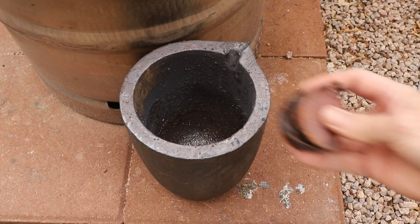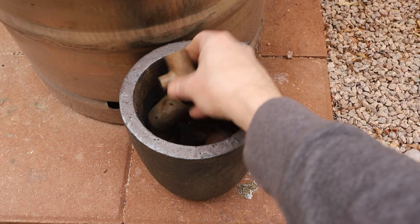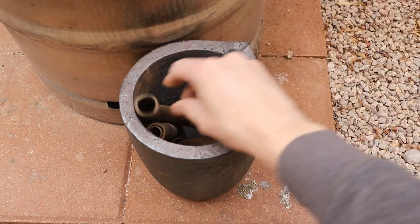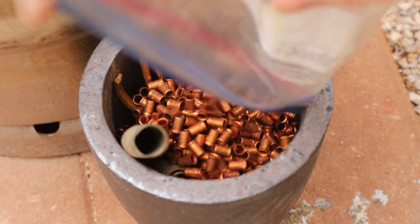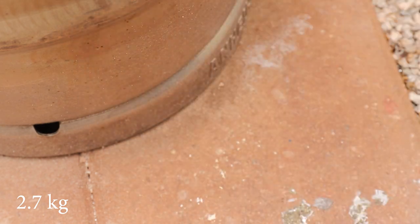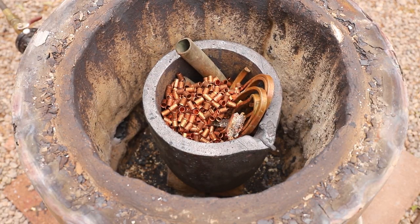Next, it was time to get some copper melted. Fusion 360 will provide the mass of an object based on the material you selected, so that's how I figured out how much metal I needed for these molds. In this case, I needed about 2 pounds for each trivet. Of course, I also had to fill in the sprue, so I added in another pound each, giving me a total of 6 pounds. I usually err on the side of caution, and it's always better to have more than you need.